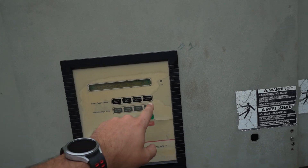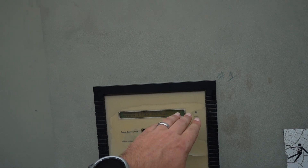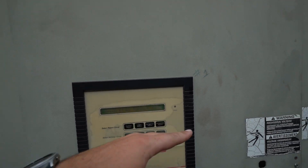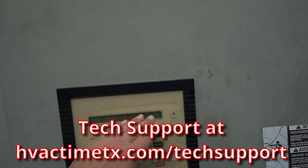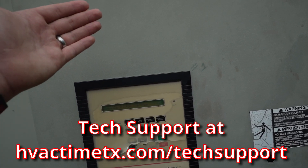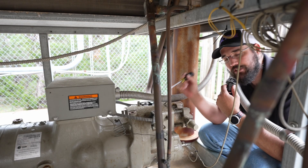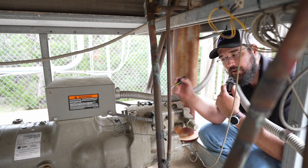It's staging way too quickly. But I could come over to the compressor report and I was only seeing roughly 50% on the compressor at startup, which is higher than I know it can be. I know these ought to be able to get down to about 40%, but 50% isn't terrible. So that made me ask the question as to what's actually happening when we go to turn on and run.